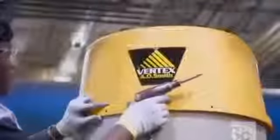A technician now fills the cavity between the inner shell and outer jacket with high-density expanding foam. This foam insulation is about 2 inches thick and goes all around the circumference of the tank to prevent heat loss. The unit then gets a cosmetic cover that conceals the blower.